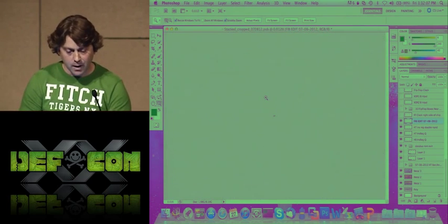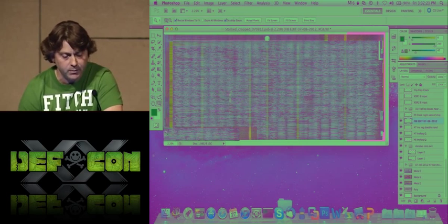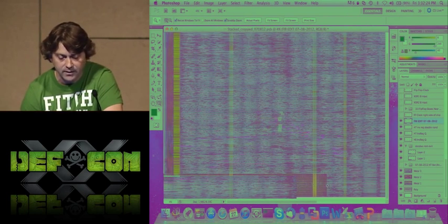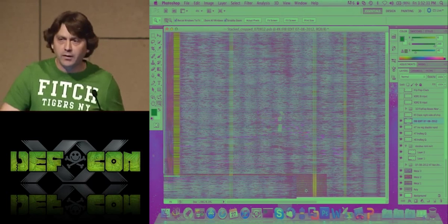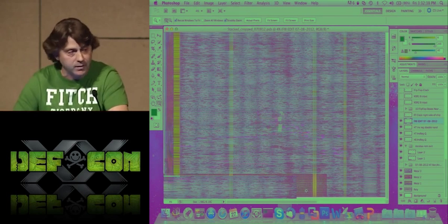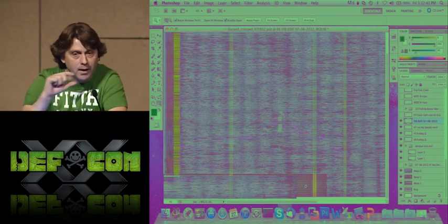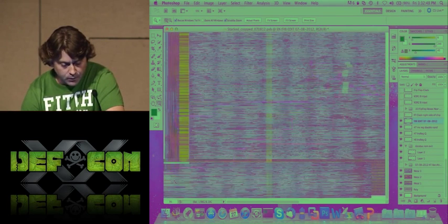And so by following the ROM, which was to our left, the ROM was to the left in this image. The ROM was over here. Now I've cropped this image. So because this image got cropped, and you can see here, I didn't even image this spot right here. It's missing. Because this is part of the math coprocessor. So this chip has math coprocessor. It can do SHA-1. It can do RSA, DES, and a bunch of things. I don't even know what some of the functions it has besides those. So I knew I didn't need that very bottom area, and I took it off. I actually went in more than I needed to in the left section. So if we look here, you can see I've been drawing here. If I turn off all the layers for a second.